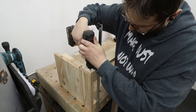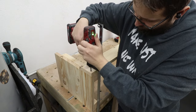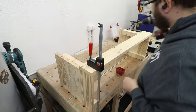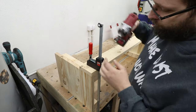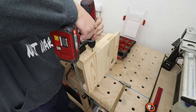Now it's time to sort out the front of the planter. Same principle: pre-drill and countersink — in this case they will be visible outside so you want a nice finish, so I'm using a countersink bit and driving in the screws to hold everything tightly. I just repeat the process on the other side and with the rest of the boards.